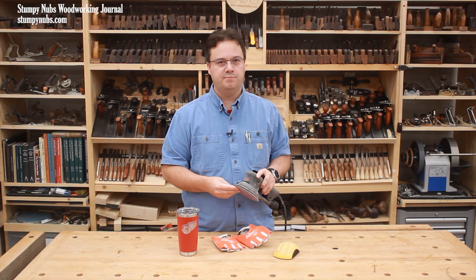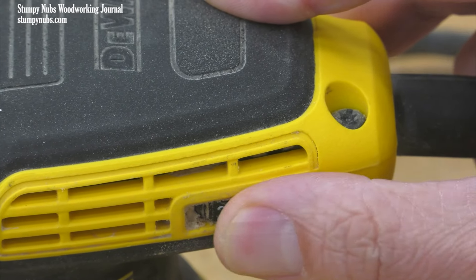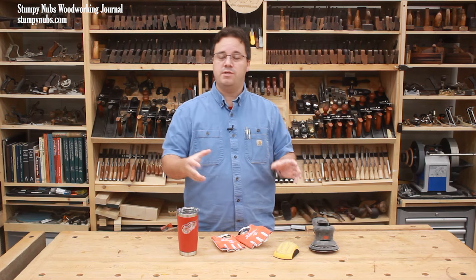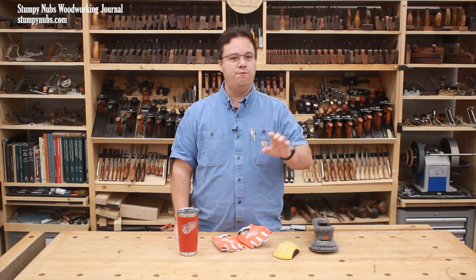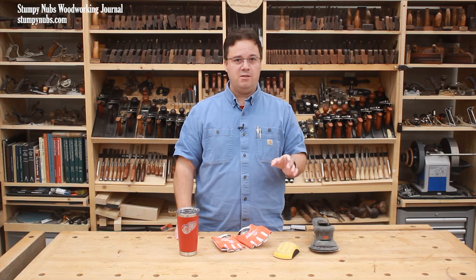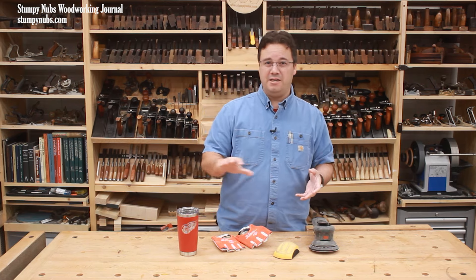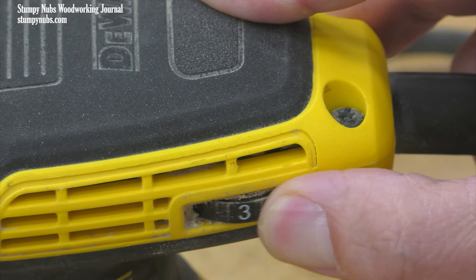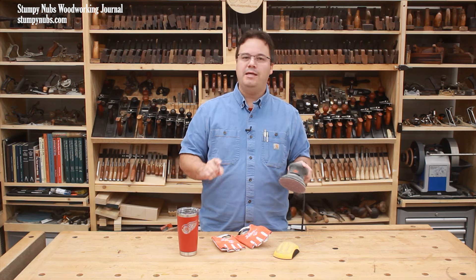One thing you should not slow down is the variable speed dial on your sander. Single speed sanders are designed to run at the optimal speed for the sandpaper, which is 10,000 to 12,000 RPM — and that also happens to be the top setting on variable speed models. They are actually designed to be run at that full speed most of the time. The purpose of the dial is to slow things down for specific applications, such as when you're using very coarse grits on veneered surfaces, or when you're sanding between coats of finish. Most of the time, full speed is the best setting, and if you aren't applying too much downward force, full speed is not going to overheat good quality sandpaper.